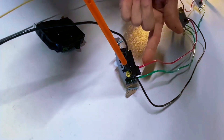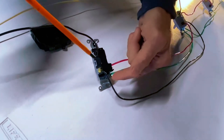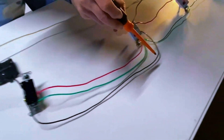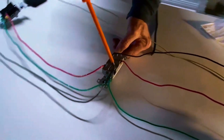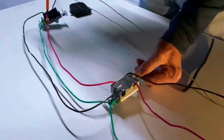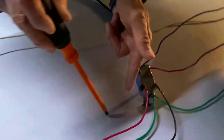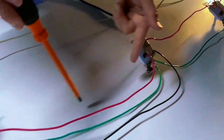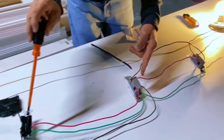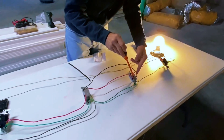We have brass screws here. Your black wire on the common side is going to go to the black wire on the four-way — that's the line side. Your red wire on the brass screw goes to the black screw on the four-way. I've got them tied together this way on the line side, and coming out load side going to the line side of the next switch.